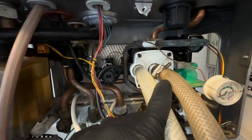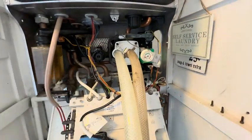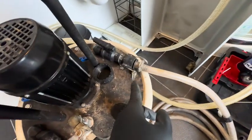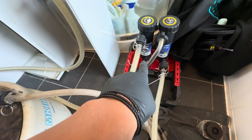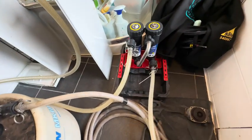Now I'll show you what we've got. The pump adapter has two hoses - the middle one is the return, that's the flow on the left. They can spin around anyway to make it fit. The return goes to your magna cleanse if you're fitting one; if not, it goes straight into one of the connections, and then there's another hose leading into the power flush machine. Think of the magna cleanse as a bridge.